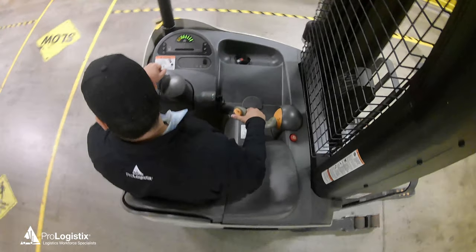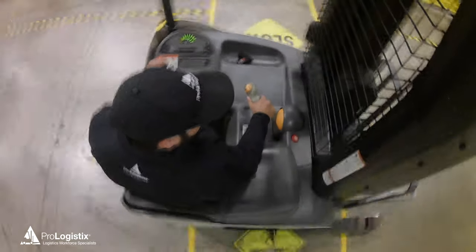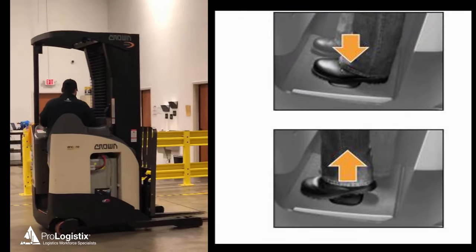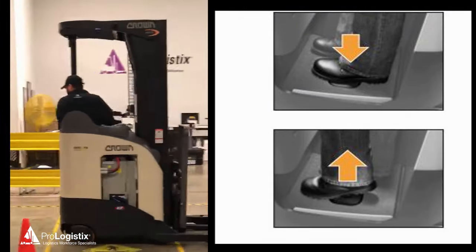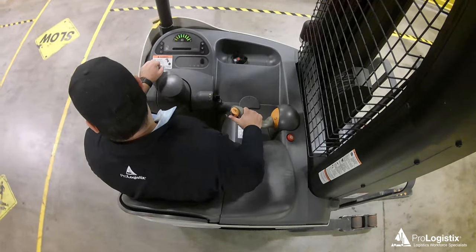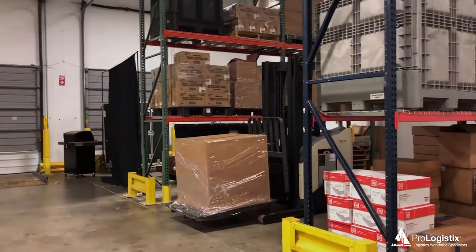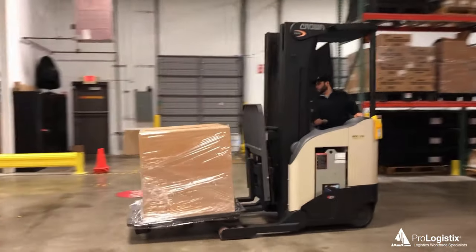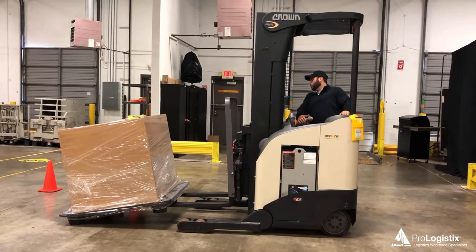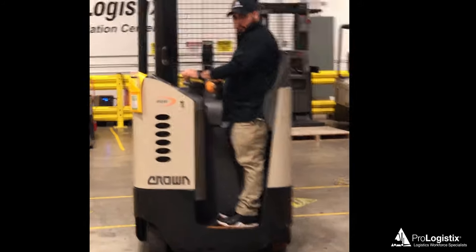What is the dead man pedal? It is a switch on the floor of the forklift. It is simple to operate but can be dangerous if you're not familiar with its functions. Never step on the dead man until you are ready to operate the forklift. The pedal gives power to whatever the forklift is doing — the dead man acts like an on-off switch. A dead man switch must be pressed for the unit to move, meaning you must be standing on the pedal to go forward, backwards, or use the forklift controls. If you abruptly remove your foot from that pedal, the unit will skid to a stop. This is not a good way to stop — you risk being thrown from the forklift, losing your load, and creating flat spots on the drive wheels. Only use the dead man to stop the forklift in an emergency situation; it should not be how you stop every single time.